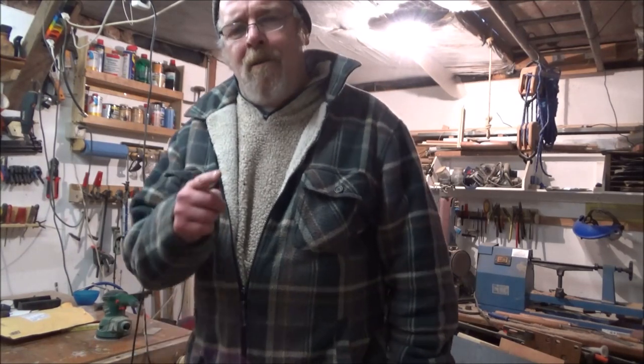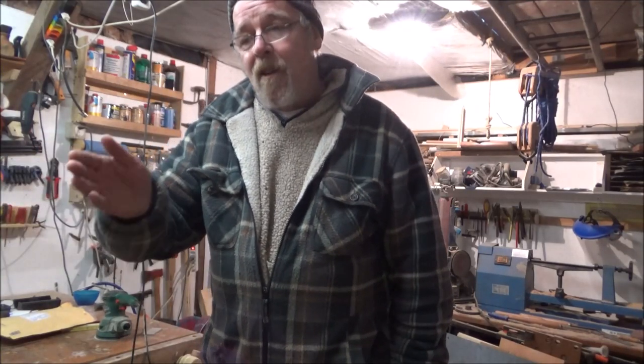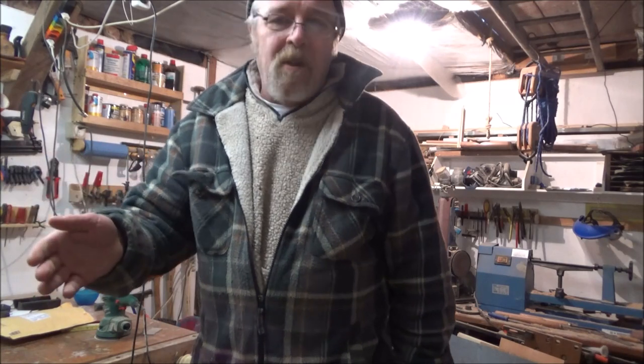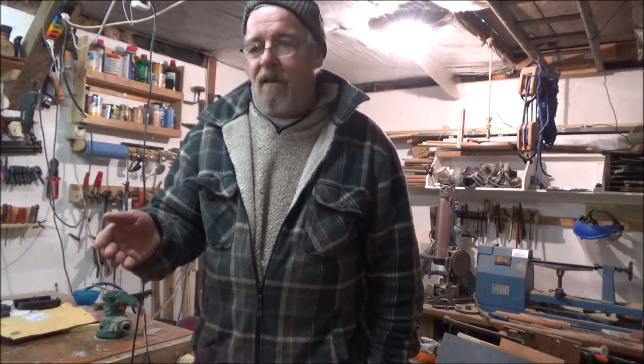So, Paul, I know you've got a new saw, Workshop Life. Use your riving knife. And like I say, I might end up cutting that one down or putting a plate on this, which would have a riving knife integrated onto it, so that I'm not changing it, because that is a bad design fault. I have mentioned that on this saw. That is one of the things that really niggles me on the saw. It doesn't make it easy to work safe sometimes, because they've got this extra height on that knife. So there's a story of woe.